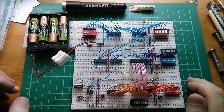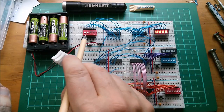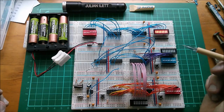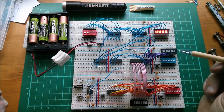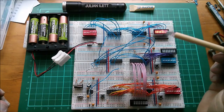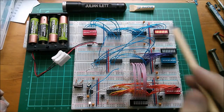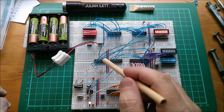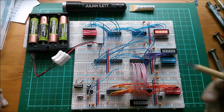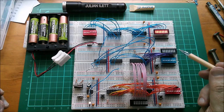Right, it's time to actually program this computer now. Now you can see that the switches here are not being copied into the LEDs here, and that's because I haven't actually written the program instructions into the computer's memory to tell it to copy that device to that device. Now these two devices are numbered 2, this one is number 2, this one is number 2, and that's defined by which output of these address decoders I connect the wire to. I've chosen 2 because I didn't want it to trigger on 0, because currently this memory has 0 in it.